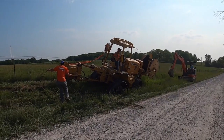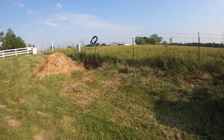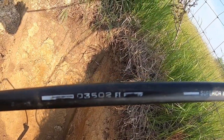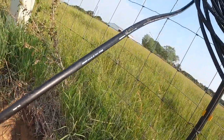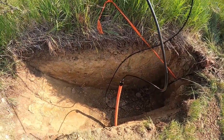Going to run through that smaller blade — way better. Gary filled in the trench there. Me and Gavin are going to work on setting this hand hole. It's 24 fiber — they got numbers on it, I think that's 3,502 feet. They go in two-foot increments, that's how we keep track of everything. We shot this bore over to here, now we're going to set this hand hole right here.